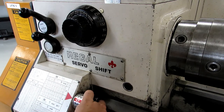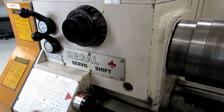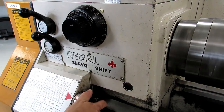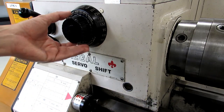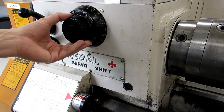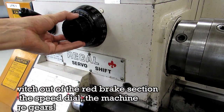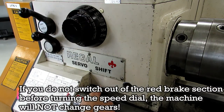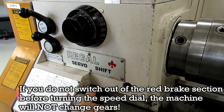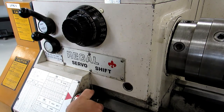At that point, you can go ahead and shift into gear and the chuck is moving at 256 RPM. So if you wanted to then switch over to, let's say, 937 RPM, again you switch out of the red section on the dial, move this up to 937, switch back to the red section. After a few seconds of that, you can go ahead and turn it back on.